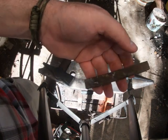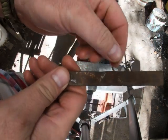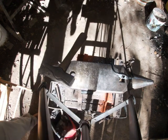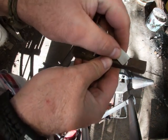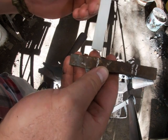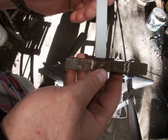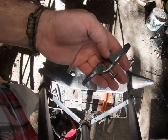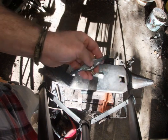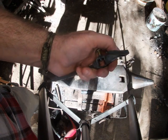I want to talk about what we're going to be doing. The first thing we're going to do is heat the whole piece up and then quench about an inch on both sides — a little bit over an inch on both sides. We're going to heat the whole thing up, quench about this much on each end, then come out, turn it upright on the anvil, and hammer down on it to upset the center so I have enough mass to put a square hole in. I wanted enough mass to make sure there was at least an eighth to a quarter inch of material on each side when I poke the hole through.